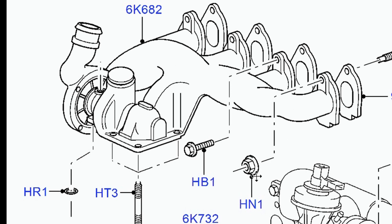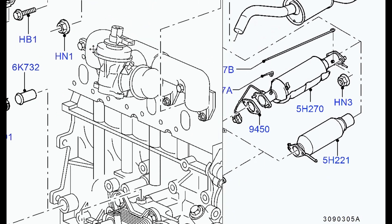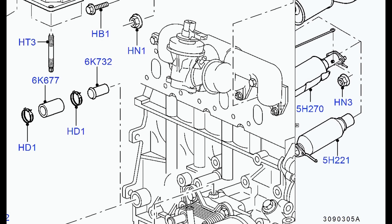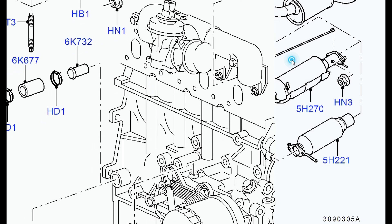They are studs, and we did have one where we undid the nut and the stud came out, but generally the stud stayed in the block. They're quite short, so if you loosen off everything else holding this down, you can by disconnecting the rubber on the back of the exhaust just pull the whole manifold, exhaust and turbo back. That's the manifold. This is the side of the engine where you can see it mounted into position without the turbo bolted on — that's actually the version without the turbo. This one's got a turbo on it.